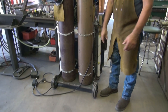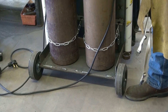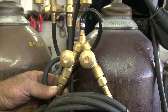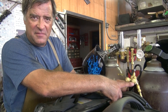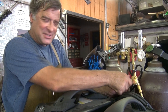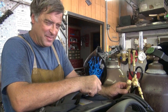Nice big hard wheels on the back so it's easy to roll. There's no shelf or anything that you have to lift the bottle over to get it into the tray on the back of the cart. I went ahead and put two chains on it to hold the bottles in place, just because of the weight and moving the cart around with the bottles rocking. Because it's running two different gases for the MIG and the TIG in the one machine, I found this over at the welding store — it's just a splitter. I can run my argon in on one side and my mix gas in on the other, and the outlet goes right to the back of the machine. All you have to do is turn on the argon, use your TIG; when you're done, close them both down, close your bottle, and for the MIG just reverse it on the other side. That way there's no hoses to change, no extra fittings — it's all hooked up right here.